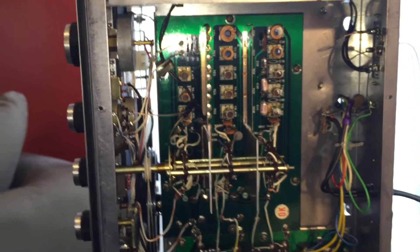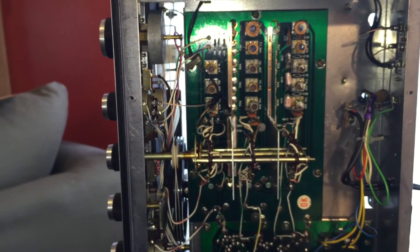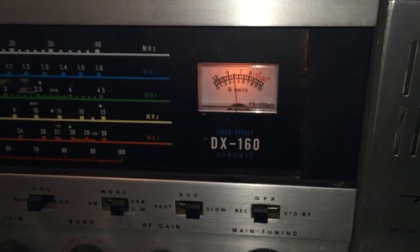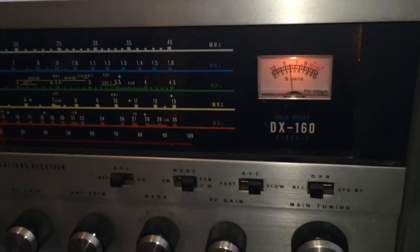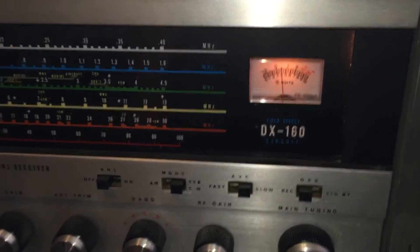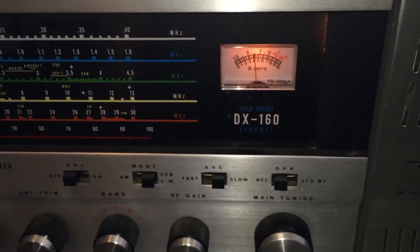If you're having sensitivity problems with your DX-160, I would target this board after you've looked over everything else overall. This is probably your problem. I'm in band E, about 14.3 or so, give or take on the dial. Between 5 and 6 on the S meter is definitely ideal. I'd usually get a solid S5 in my car, and although right after the initial fix I was seeing a good S5 or just slightly under, very shortly and gradually it started to diminish. I did the fix a couple hours ago and it's still holding strong, so I should have good sensitivity here.